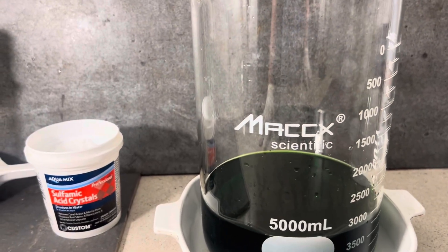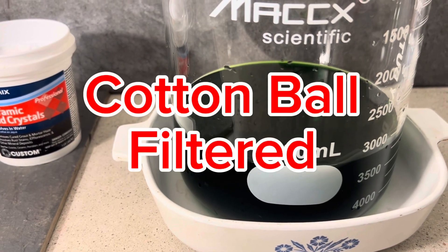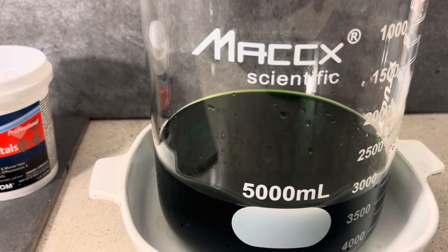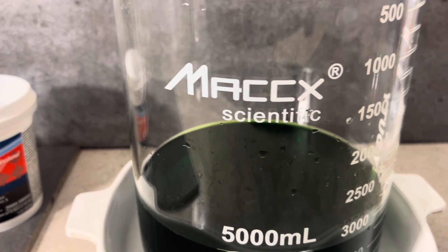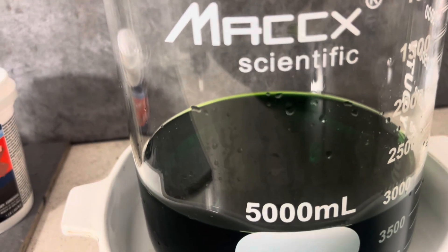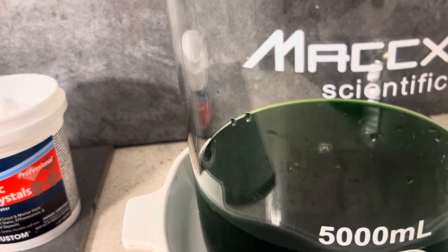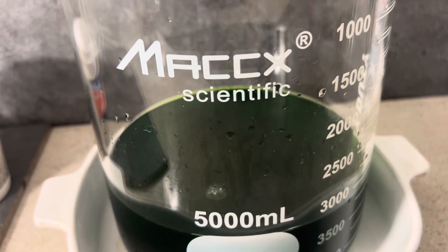This here is the filtered aqua regia. You can see by that green color that we have quite a bit of copper in it. I'm going to use sulfamic acid to neutralize a little bit of excess nitrate — I'll be spooning that in, and then we will add iron sulfate to the mix to drop out the gold. I'm not seeing much of a reaction, so I'll add just a little bit more and stir.